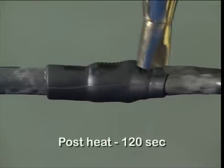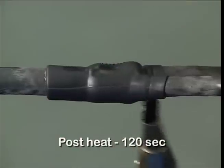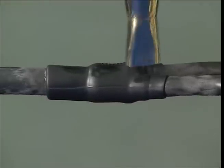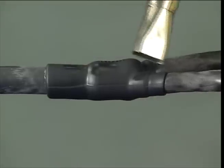For /86, after the part has been fully recovered onto the cable, apply 120 seconds of post-heat evenly around the moulded part at the cable ends. Take care not to scorch the moulded part.